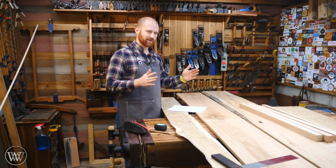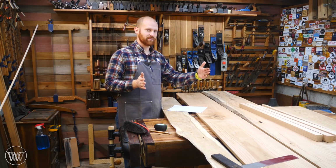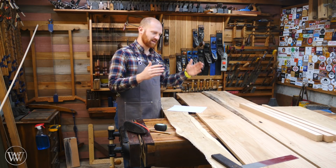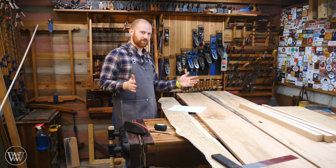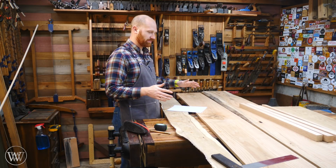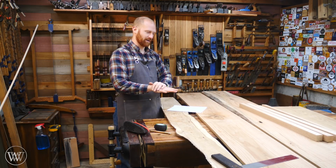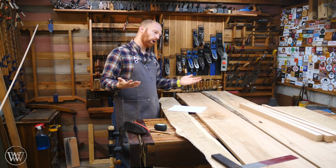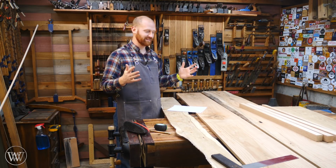And I thought I could do that because I have a piece of white oak with a very, very wide board. And I thought it was 18 inches wide because this top is 18 by 18. And so that would have been perfect, but the board was actually 17 inches wide. Oops. So I'm actually going to be laminating the top up out of 2 boards to make an 18-inch wide top, which, oh well, that's going to be 1 glue joint in this. The rest of it is going to be completely without glue.